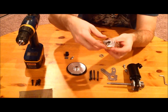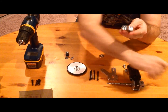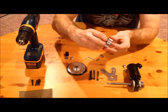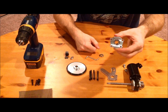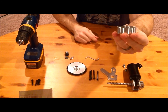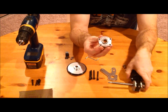Take the second bearing and do the same thing — make sure it's sitting flat, because if it's not sitting flat it will not go in. Just take your time, make sure it sits flat and nice and easy, then push it down. The last one is the easiest because it only fits about halfway down into the hole. So you've got that sitting about halfway down, and this is now ready to mount onto your motor.